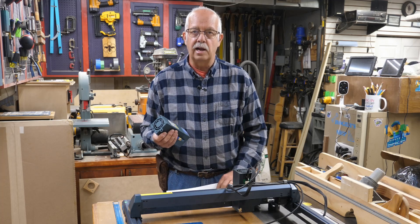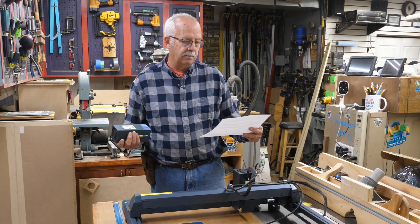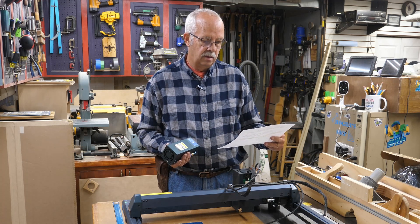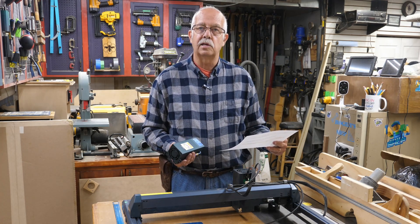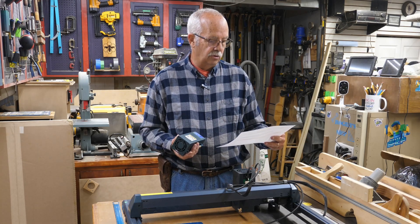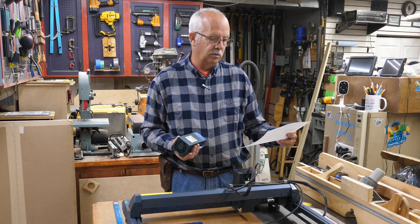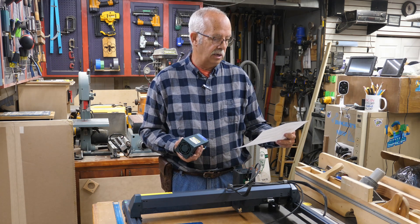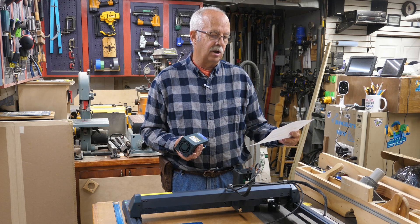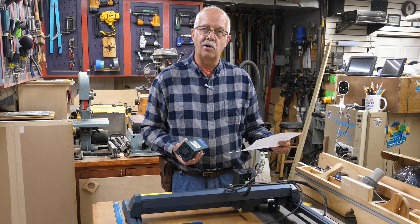So what are some of the specs? It's got eight laser beams combined with a spot size of 0.10 by 0.15 millimeter. That's a pretty small spot size for a laser of this power. It can cut through a single layer of 20 millimeter poplar, 9 millimeter bamboo, 0.15 millimeter stainless steel sheet with multiple passes, and cut through 40 millimeter poplar, 50 millimeter black acrylic, and 30 millimeter pine. So that's got some pretty good power to it.